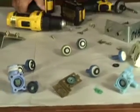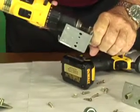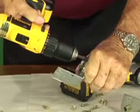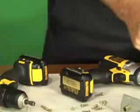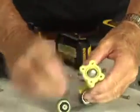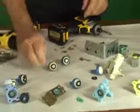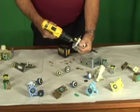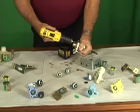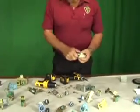Each of these valves that we've looked at, in this particular valve, we can see severe corrosion in the internal screen. We'll disassemble it. If you notice on this screen, again, we have mineral deposits, chemical buildup, and that of course would cause the valve to malfunction and be unable to control the water flow. We've disassembled a number of these valves. The question comes down to whether this should in fact be considered destructive testing. These are mechanical fasteners that are put in so that the valve can be disassembled. I would think that this would not indicate necessarily destructive testing, but a disassembly.